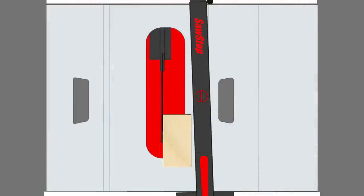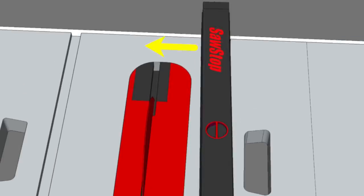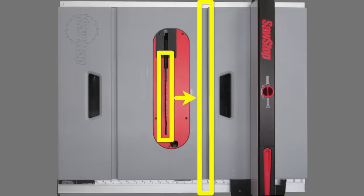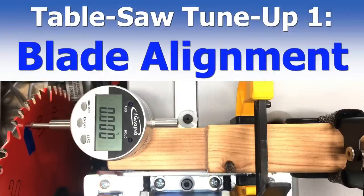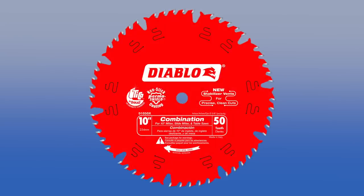In order to help keep your stock from being pinched between the fence and the blade, make sure your fence is aligned properly, and not towed in to the back of the blade. See my video, 4 Easy Ways to Align a Table Saw's Fence, for more information. And consider checking your blade's alignment. See my Table Saw tune-up video for more information on that. There are links for both these videos in the description below. If you have other tips for preparation steps that help prevent kickback, please leave them in the comments too. For example, I've read that kickback can be caused by using the wrong blade. I always use a combination blade when I'm not using a dado stack. Are there times when using a combination blade could be tempting kickback? Let me know in the comments.